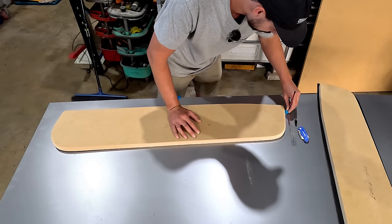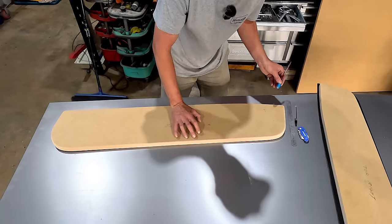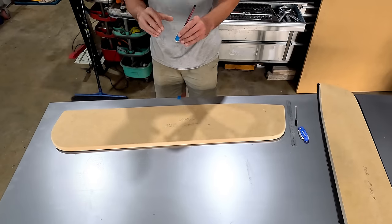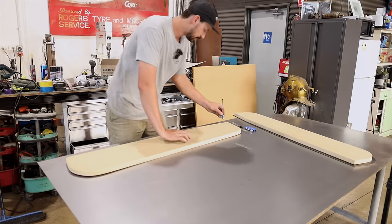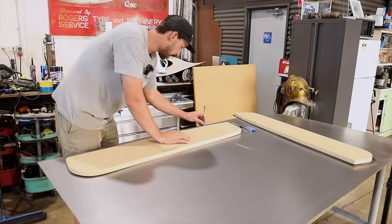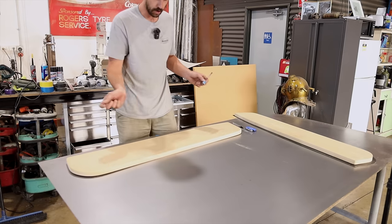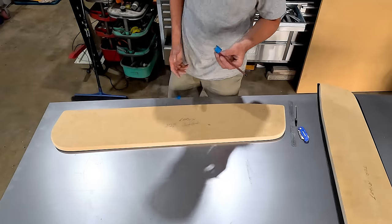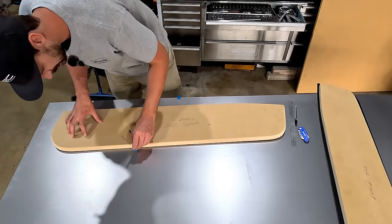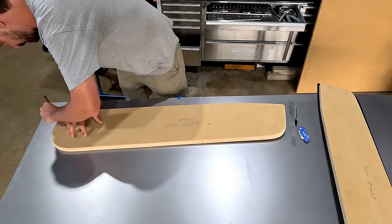And the bigger the lip, or the more material you're gonna try and fold, it's gonna make it really tricky because it's more material that needs to be shrunk. So kind of the shorter, the easier it is. Even 20 mil might be a little bit too much. If so, I can just go back and sort of trim the edge to knock it over. I've had to do that a couple times in the past, but hopefully we'll be able to get this one.